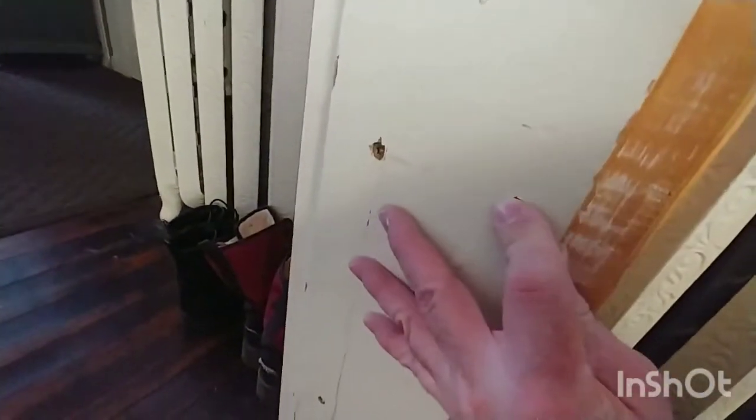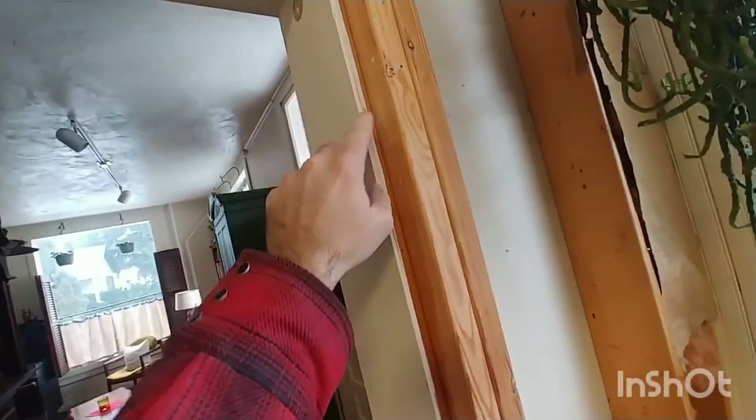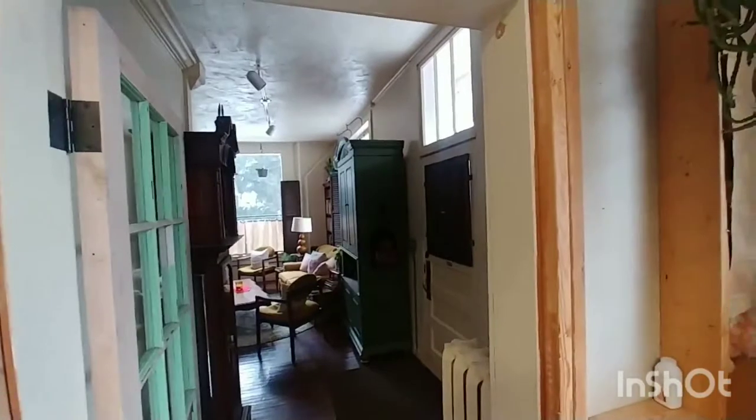I had to smash this jamb over on the rough framing. You know, there was a bit of a gap behind the jamb on this side. I had to pack that over tightly. And to get it to go and stay, I had to use screws. And in the process of tapping it, it split. Because, like I say, it was manufactured. But it's probably from one of the mid-century home projects that I did. I took an interior door out of a wall I removed. And so it's, you know, 60, 70-year-old timber at least. Anyway, it cracked on me.